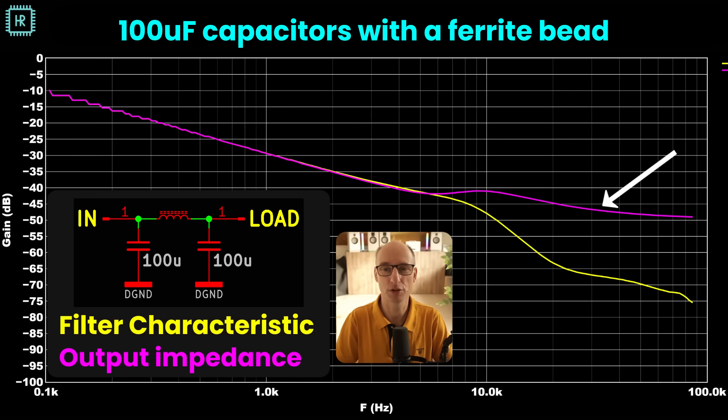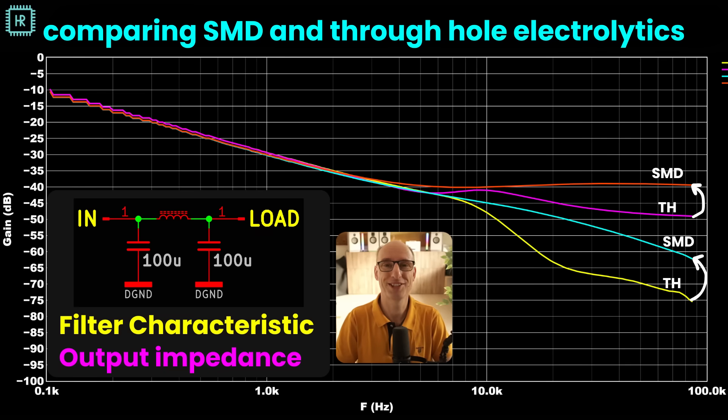What I want to show you next is an effect that contributed to a very expensive fix in RTX video cards — I'll put an article link in the description. The purple line flattens off a bit, probably since I'm using normal through-hole aluminium electrolytic capacitors. I wanted to try a standard SMD aluminium capacitor expecting better performance, but to my surprise things got worse — standard aluminium capacitors have the worst impedance, almost anything else is better. The difference is more than 10 dB for both measurements, which is at least a factor of 3, showing the impact of different component types. Something similar happened in the RTX 30 series cards, which forced an expensive redesign — it was not a single cause, but the capacitor choices definitely had something to do with it.